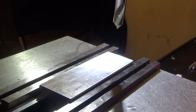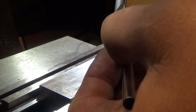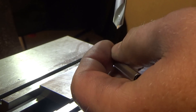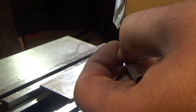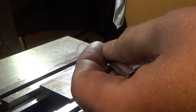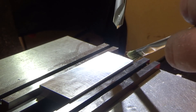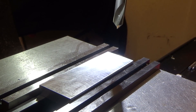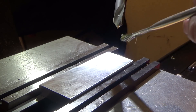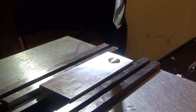I did clean this up off camera — you know how I like my shiny metal. I'll flip it over and do the 10-24 through, halfway with a clearance hole and threads on the second half, so that you can pull it tight. I'm only going to show you one side of each because the idea of what this tool does is a lot more useful than watching it being made, so let's just get right to it.